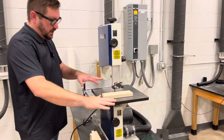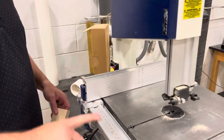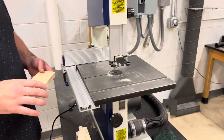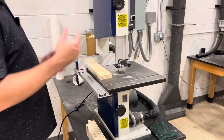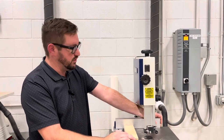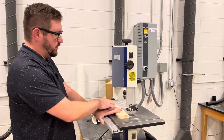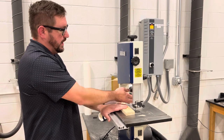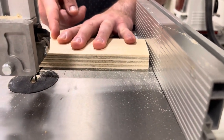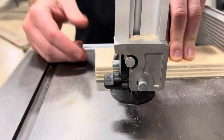On our bandsaw we have our table right here. The table also has a fence which can be locked into place, and we have our measurements right here. We're going to be cutting two six-inch pieces and two five-inch pieces. A big thing when working with the bandsaw is to have your fence secured so nothing moves, and your blade guard at the right height. As we're cutting, we also want to make sure this piece of wood stays flush against our fence. If we start to turn and get a gap, the line is not going to be straight. You need to focus right there and watch where your hands are at all times by the blade.